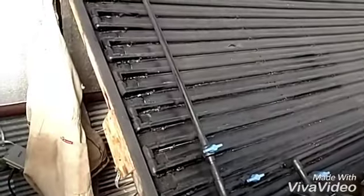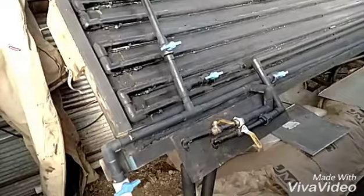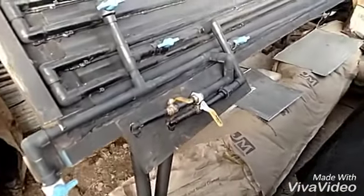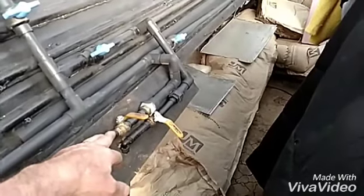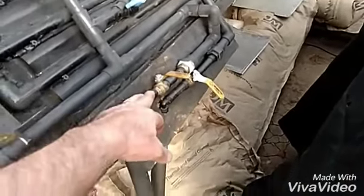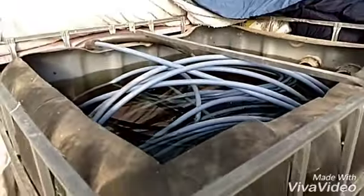Now on this side, the water runs back through here, and I can shut it off and run it through this tank over here, so it's a separate coil where this goes into this end tank over here. So here's the heater tank exchanger, so I've just got half-inch PEX running through there, and that exchanges the heat out through that, and that circulates through the rest of the tank there.